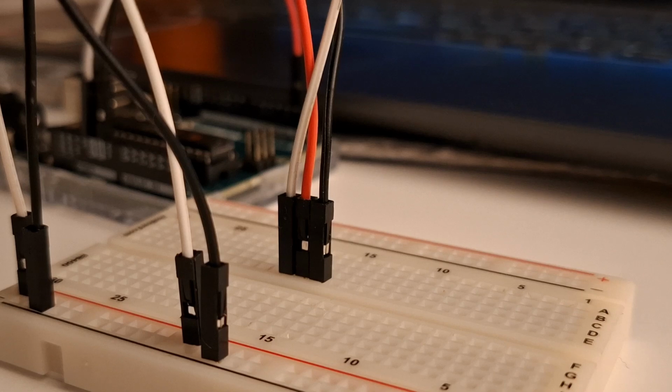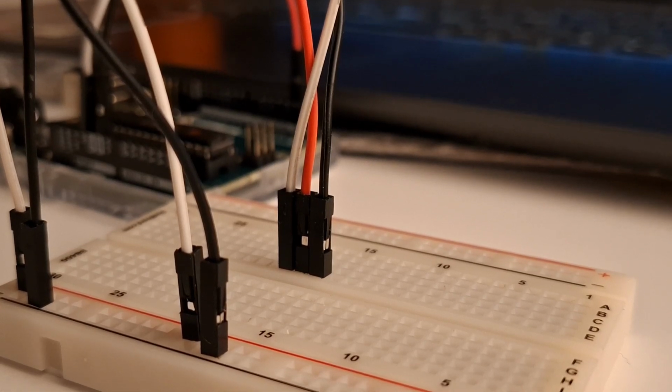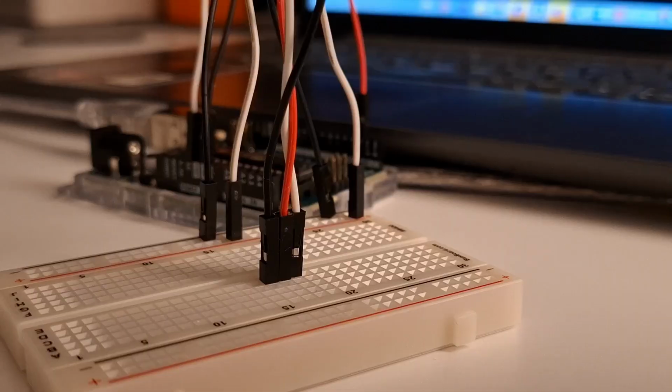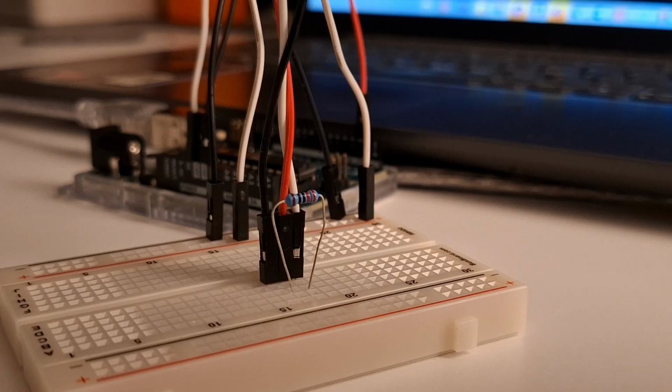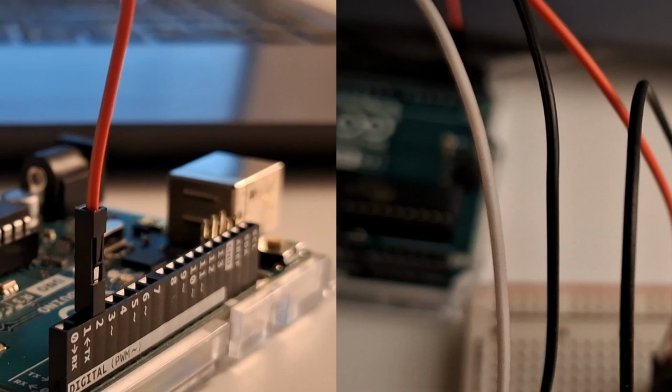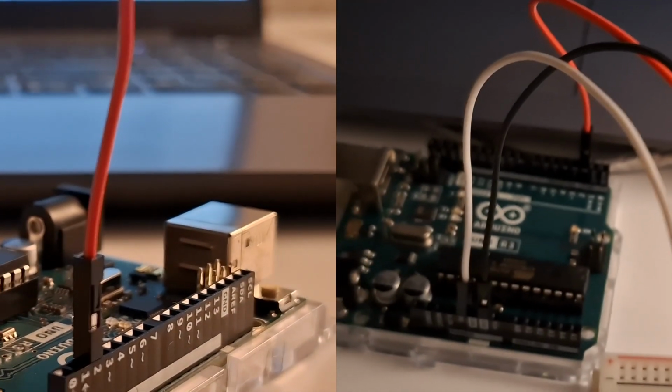Now let's connect the power rails to the terminals. Also, don't forget about connecting the red wire to the breadboard. I also decided to add a pull-up resistor, building a bridge between the positive and signal pins. Later, it will help us prevent sensor reading failures by stabilizing communication.